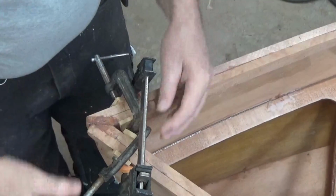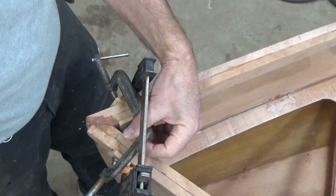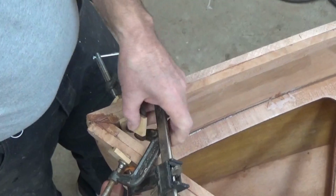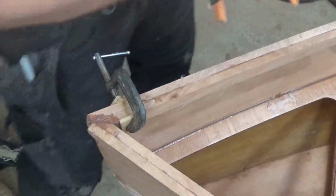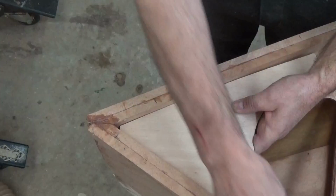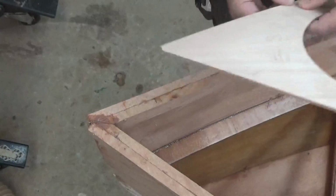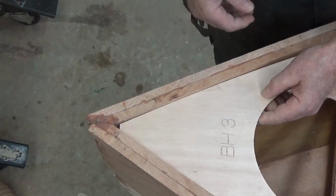Well, I'm really hoping that that thickened epoxy inside the inside stem is really going to hold the bow together. It looks like it is. Okay, come on. Alright, so that's held together quite nicely until we get a nice breast hook in here. So we're not going to use this plywood piece. I mean, I know it's all to keep things super light, but that's not really an issue for Doug, so we're going to go and make ourselves a nice mahogany deck in there.